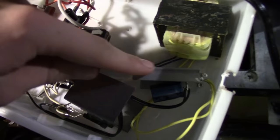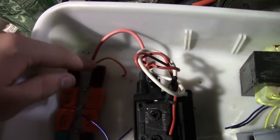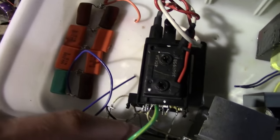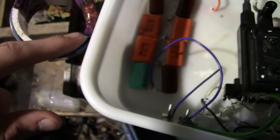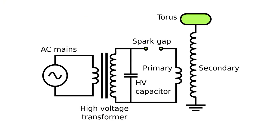Here's our finished setup: we have our 120 volts coming into our transformer, going around to our rectifier, which goes into our flyback driver — the two resistors, the transistor, and flyback. We have one end — the positive end of the high voltage — going to one side of the capacitor; the negative end of the high voltage going to the other side of the capacitor. The negative end of the high voltage also goes to one side of the spark gap; the other side of the spark gap goes around to one side of the primary coil; and then the other side of the primary coil comes back around and hits the positive side of the flyback. I'm going to put a little circuit diagram in the video right about now.